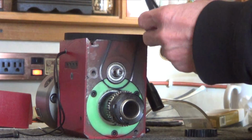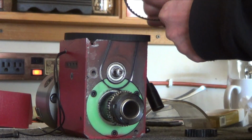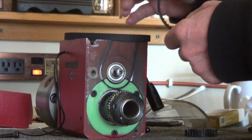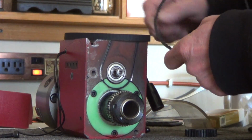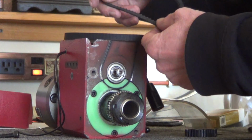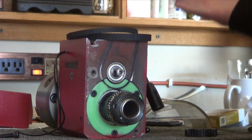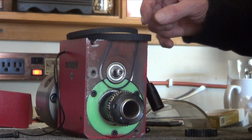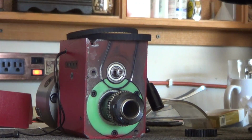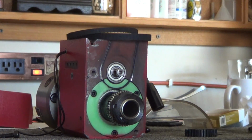And I was looking at the surface. The teeth really didn't go down, but the entire surface, all over the teeth, the sides, in between the teeth, it looks like you took felt and rubbed it a whole bunch with something and fuzzed it really bad. And the fuzz doesn't come off. It's still there. You can't clean it off or scrape it. But it's really, really bad fuzzing in there. So I guess that's the combination. Probably because it's too skinny, there wasn't enough tooth left to hang on, so it would skip. Because I'd be spinning it and I just put my hand on the chuck and you could hear it starting to slip. So, oh well.